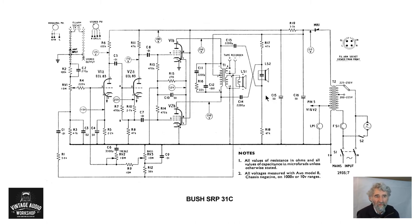It's also safer — although this does have a three-wire mains, a lot of people leave the earth off, or may have plugged it into a two-pin socket, since this is old enough that many places still had two-pin mains. So you could get a voltage on the chassis. The transformer isolates you. So it's safety, plus eliminating a hum loop, plus you do get the effect of the tone controls — which are in the feedback. The feedback is applied to the grid of the first valve in two places.